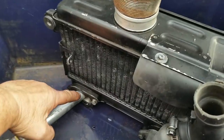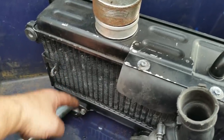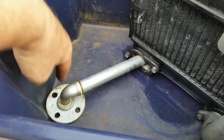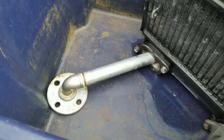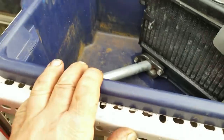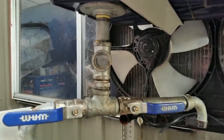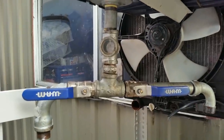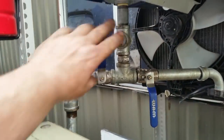I'm still to make a flange to fit this part here, but as the diesel is cooling it runs out of the bottom and runs down here into this part. This flange will be connected with one underneath and the product will then move through the bottom of this bath and connect to the rest of the plumbing here, where it will travel through the sight glass and we can control the destination of the liquid between the two containers using the valving system here.